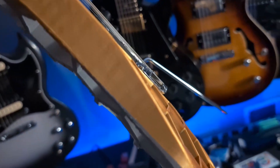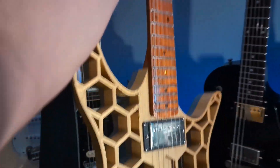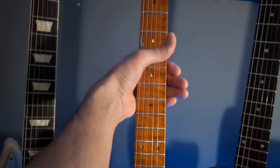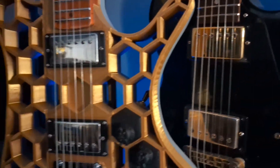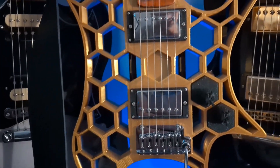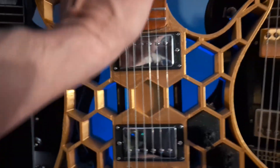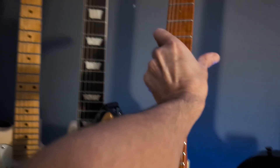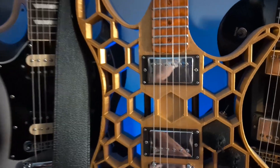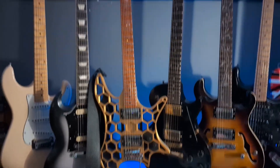You can see the ripples in the side. Even though it was a successful print and I think it looks pretty good from the top, it's not nearly as good as I was hoping for from an aesthetic standpoint. But functionally, I am thrilled. I changed the profile where your arm rests to make it a little easier when you play. I added the reinforcement rods, and I also added a belly cut to make it more comfortable where it sits against the body. Adding the tremolo are the big changes I made to this design. Let me know what questions you have.